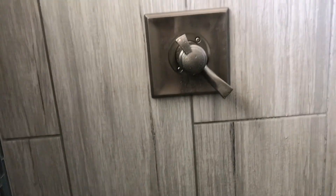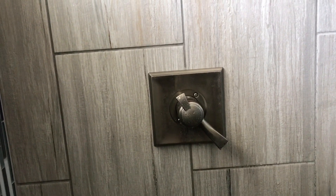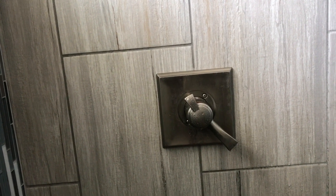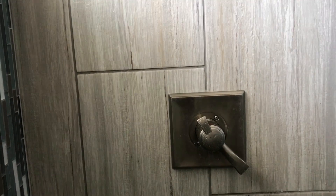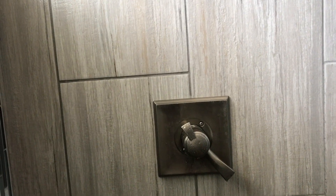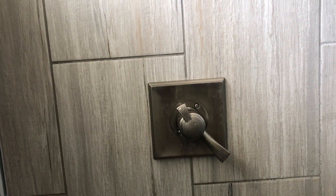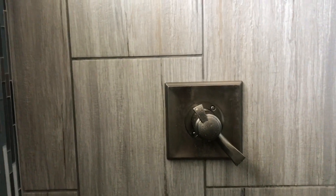That universal valve replacement, I think it cost me $25 on Amazon. I had to remember what trim kit I had to make sure it would work — this was a Delta Multi-Choice 17 series. When you look at Home Depot or Lowe's, the replacement valve bodies will say it fits a 13, 14, 17, or 18 series. In the store they wanted $30; I pulled my phone out right there, found it on Amazon for $25 with free shipping, and went for it — saved about $5. Just make sure you get the right cartridge for your particular trim kit to make sure it's all going to line up. But it's looking like it's fixed — I'm super happy with that.